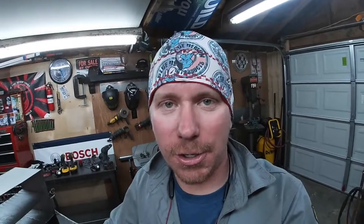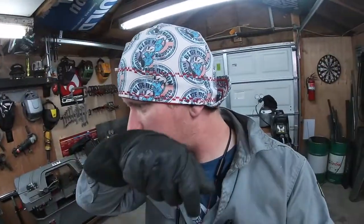Holy Moses, dudes. Some of the welds on this thing were hard — hard, hard, hard. I think this material is 20 gauge, not 16. I grabbed a piece thinking it was 16, but it's 20. Tacking off to that expanded metal — some of those welds were freaking tricky. You've got to get the expanded metal hot enough without burning down the 20 gauge, and you want to not warp it. Anybody who can lay a sick, consistent weld with no warpage on thin material — I don't know. But I'm happy with how it came out. This thing's pretty sick. Enough goggling at it — it's time to attach this baby to the wall, throw it up, load it up, and get the final pic.